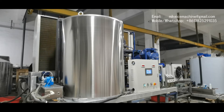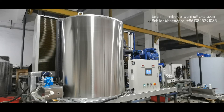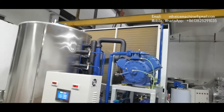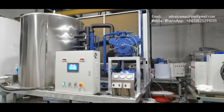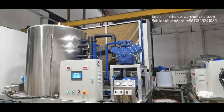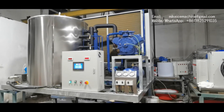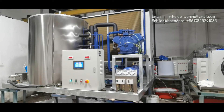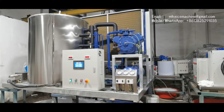The machine is equipped with a 40 horsepower piston compressor and an air-cooled condenser. It is very power-saving. This is the air-cooled condenser. You can see the color — it's made out of copper fins, because the machine will be used near the sea and the copper fins will last for a long time in marine working conditions.